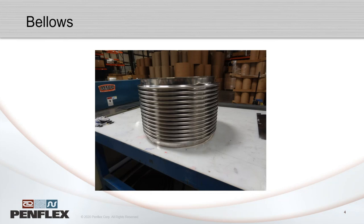The bellows is what does the magic in the expansion joint. It's a cylindrical piece of metal punched out to have convolutions — it looks like an unbraided metal hose because it essentially is one. The difference is that the corrugations are designed and manufactured based on a code, ensuring they're all symmetric. A metal hose doesn't have that uniformity or a code that guarantees pressure capacity or movement capabilities. That code-based design is what moves it from an unbraided hose to an expansion joint.